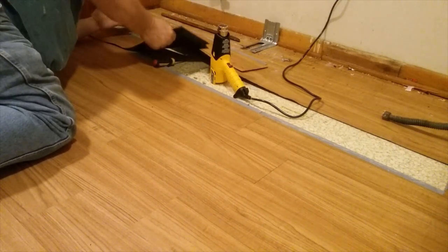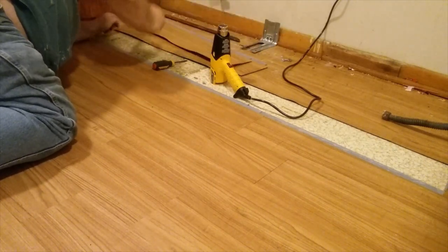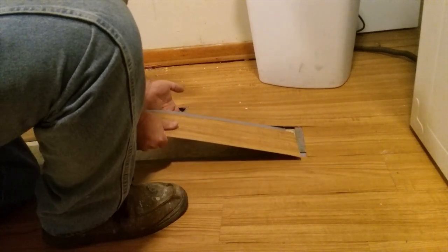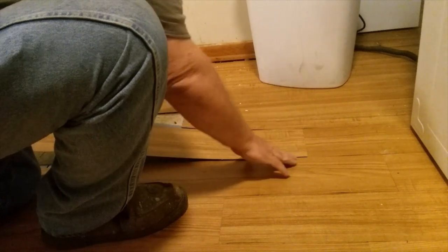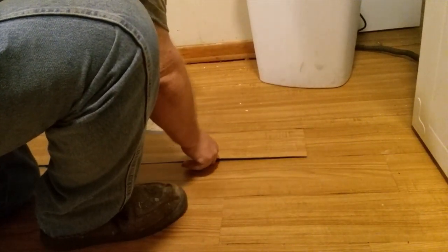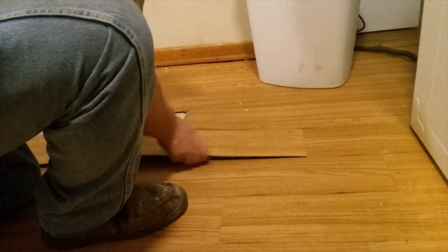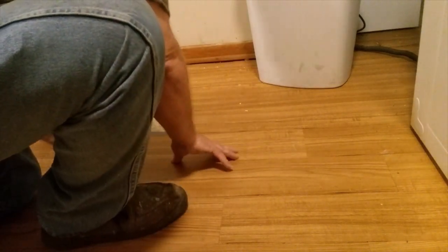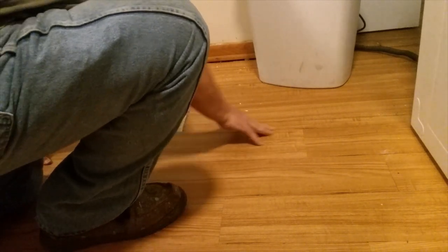That's how you get allure planking out. Going back in is really easy — just slide it up under there. The hard part is sliding it under, but you want to get everything just right: make sure your joints are nice and tight and glued down. Run your hand over it and make sure one section is not sticking up above the other. If so, take your rubber mallet to mash it down.